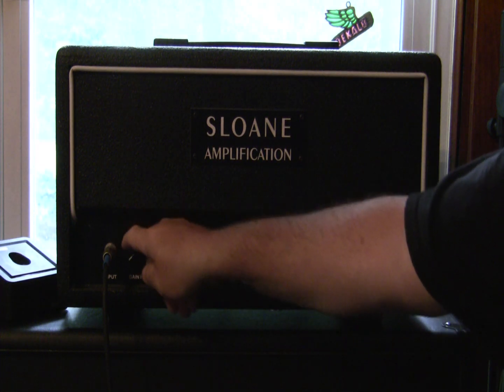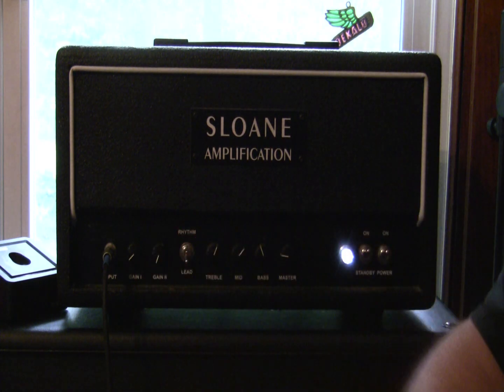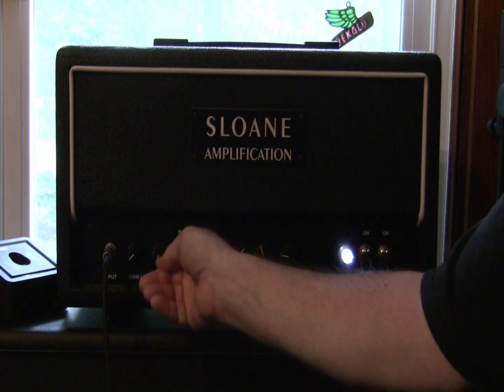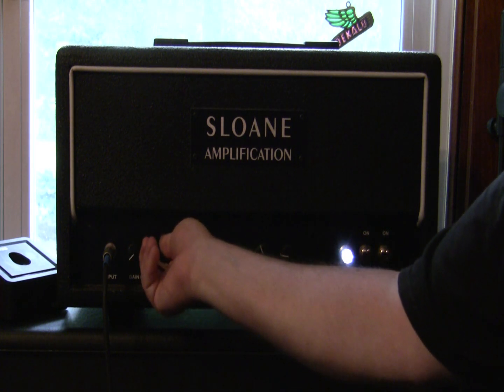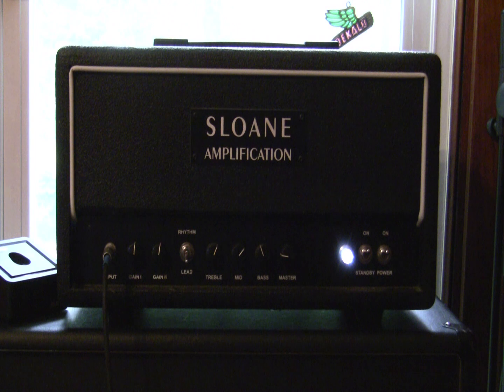and this is what I was telling you before, if I switch into lead position, now one of these knobs is misaligned. These are both all the way down, and you get nothing. You get nothing with either of them all the way down. So they're interactive. You've got to use them both in position two, the lead position here. But say I put this one up here about midway, and put this one up here about midway, you'll hear that it is considerably higher gain than the initial place where I started in the first part of the demo.